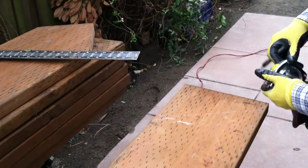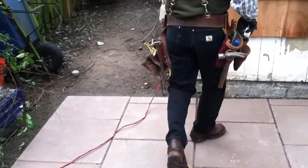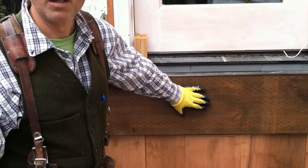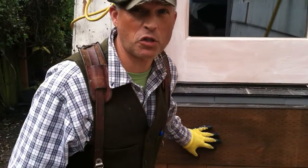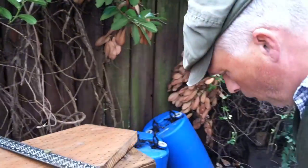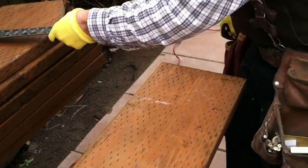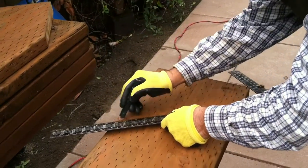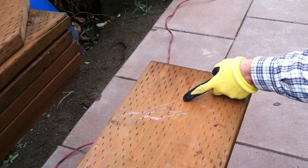Remember that our treads are 10.5, correct? There's our 10.5. But if you follow me this direction, you'll see that this band here is 1.5 inches thick. We want our tread to be back in line here, so we need to take 1.5 inches off the top of our stringer to bring it back in, so we still have our 10.5 inches here. So I'll measure over 1.5 inches, and of course I already put this line here, and I still have the stops on my square. So that's our rim. That gets cut out of it, so we still have this 10.5 here.